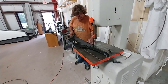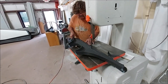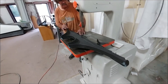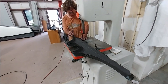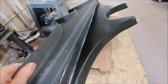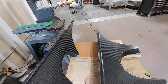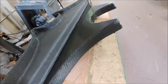Here's Jeff just doing a rough trim on one of those mounts on the bandsaw, and later on we'll get a little bit more detailed trim. Didn't take long to do those. It's kind of neat having the cantilever — it really makes the cabin stay nice and clean and organized instead of having everything bolting to the floor. There are the two of them, pretty much trimmed off, ready to have the holes drilled in there for where the seats mount, and then they can be bonded into the fuselage.